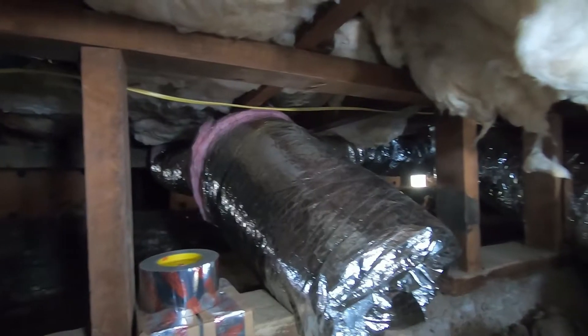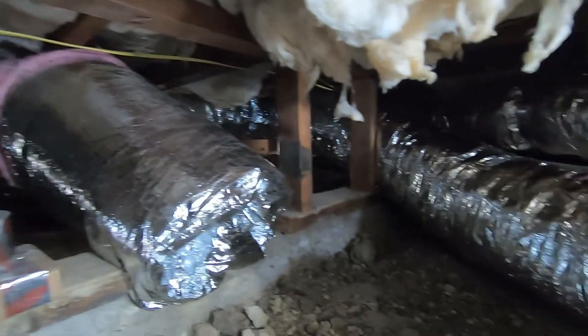Here is that duct that was really close to the unit — I was going to connect to the side of the supply plenum but decided to loop around instead. I connected it to this tee so it loops around and won't blow like a hurricane. Quick tip: whenever you can avoid it, do not crisscross your ducts, because every time you do you reduce the space and make it more difficult for other trades to get through.